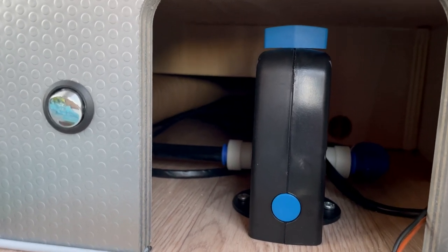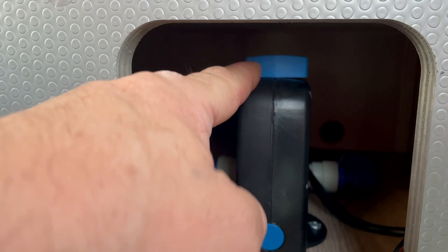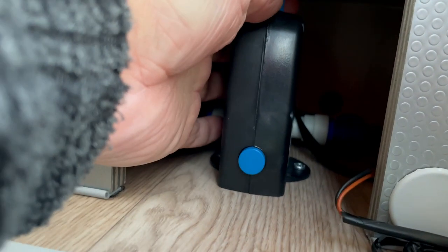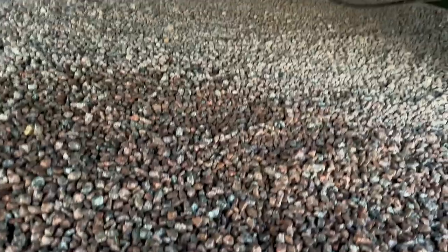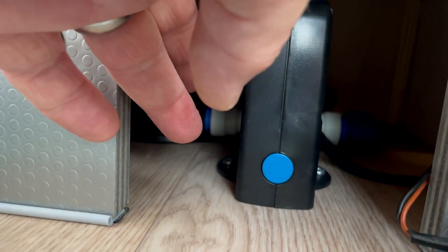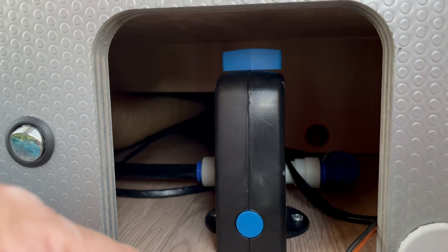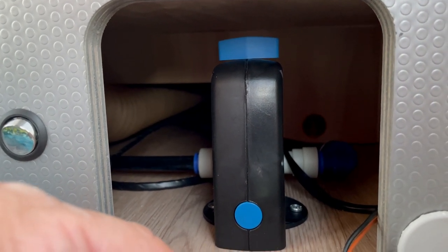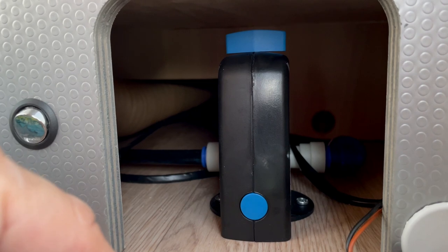When you want to drain off the boiler, you turn this lever here to the back position and the button there pops out. You can see it's quite wet down there — so that's what you do when you drain off: turn the lever in that direction, this pops out and the water flows. Now, this is a safety mechanism, but if the temperature drops below three degrees, this will automatically pop out regardless of lever position and just drop all the water out of your boiler.